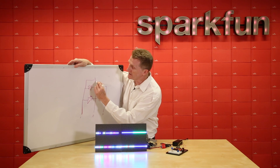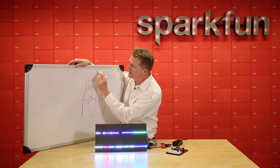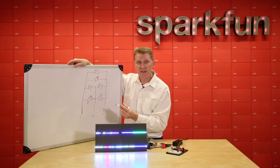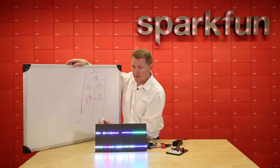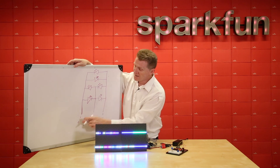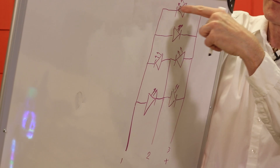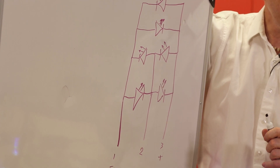Let's add one here and one here. Now we've got even more options. We've seen the first four options. We put our high line here and our low line here with two inactive — this is the path of our circuit. We get a fifth LED. Switch those around, and we get a sixth LED. All from three pins. It's all nice on a whiteboard, but let's take a look at it close up in action.